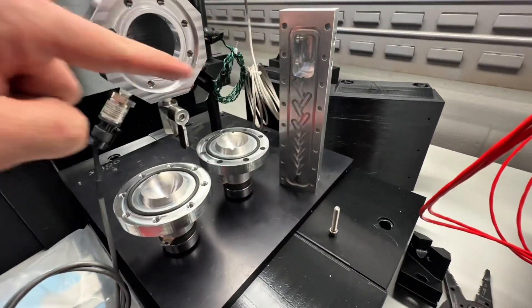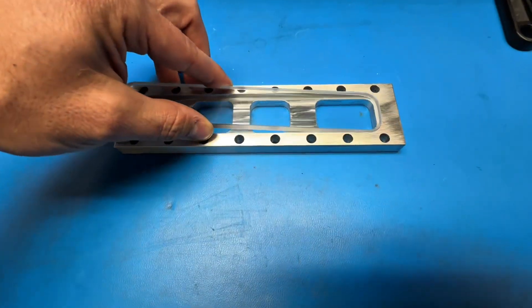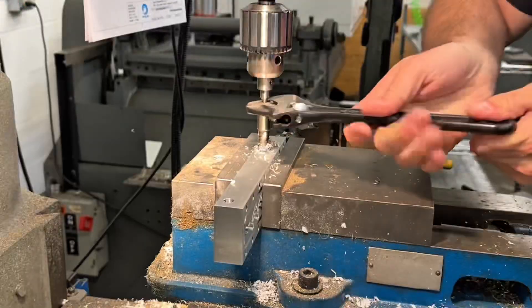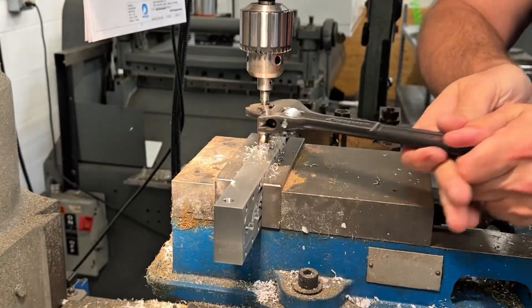We have to cut our glass for the front and then do our front pressure cover, and then we'll be done with that assembly. My setup for cutting glass here at the shop is not great, but it parallels what I do when I sharpen carbide for lathe tools — it involves this little diamond bandsaw and then a gem faceter and a few other things. We're done cutting and grinding the glass; let's put it in the cover. A little bit of wiggle room — perfect. Just tapping the last of the quarter-NPT holes and then we'll be done with all the machining operations.